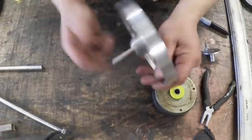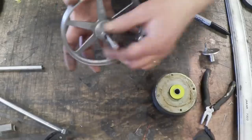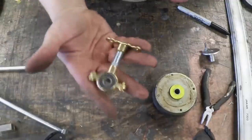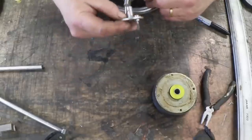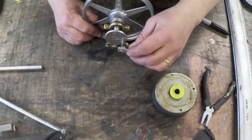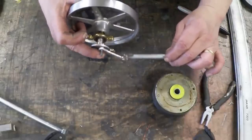Now we need to put the actual flywheel together. Clearly you could use a big cog if you wanted, or put a drive belt around this, but that's what I'm using — it's on a bit of 8mm rod as a bar. Then put a spacer on there, and then our bearing, which is a skater bearing in a Munson ring. Then we put that on, which is our crank, and that goes on there like that. Put a pin through it, and that's the actual crank mechanism more or less done. This bit goes on there, and then the cut-off piece of rod that we had goes on there. I need to fasten all those together and mount them on a pretty board.